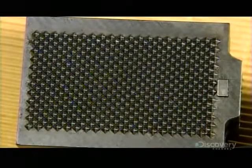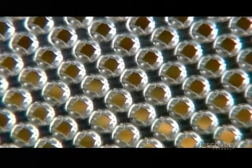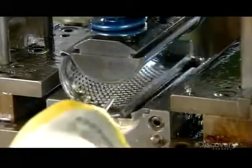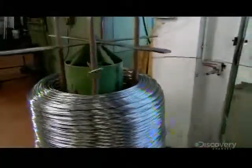Stainless steel is the ideal blade material because it's food safe, durable, and rust proof. For this model, the next step is to curve the blade — they insert it into a press that bends it with a rounded die. The press also turns over the edges along three sides, forming a channel for a handle.